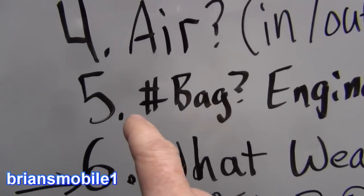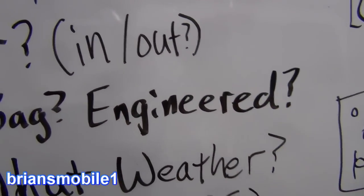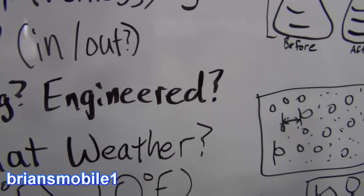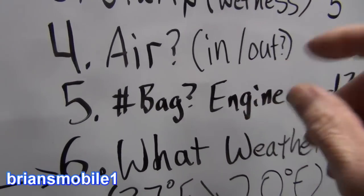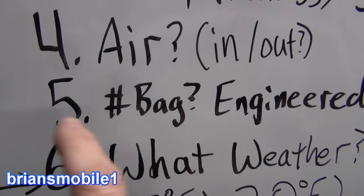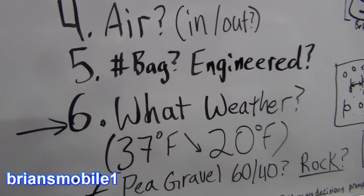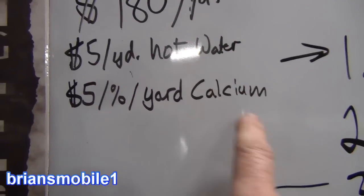The bag mix is your strength. If you only want 2,500 PSI or 1,000 PSI, you're going to have a low bag mix number. If you want seven bag — engineered or not — the filler is the ash I talked about earlier. If you have ash in it, it'll basically have the same strength but may cost less. It's good insurance to say I want a seven bag full — that means the full mix, no filler, no ash. Then they want to know what weather you have, and they can recommend things like hot water or calcium.